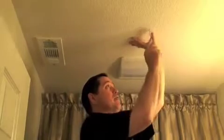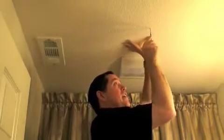The first thing we're going to do is select the center location in the room and mark that. The client asked for the fixture to be somewhere in the center. Let's go ahead and put the box up there and get that cut out. If there's a stud exactly where this mark is, we could simply mount the fixture to the stud. To determine whether or not there is a stud, we're simply going to make a hole in the ceiling.